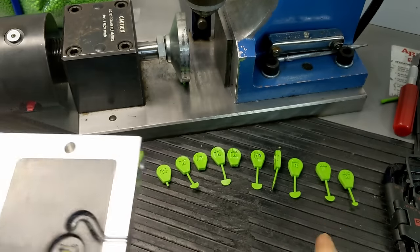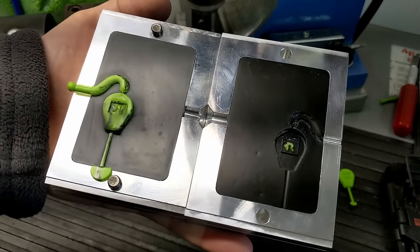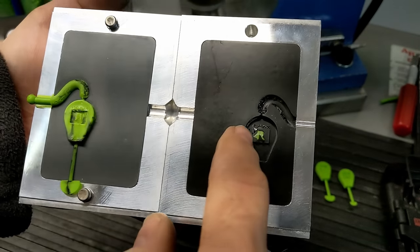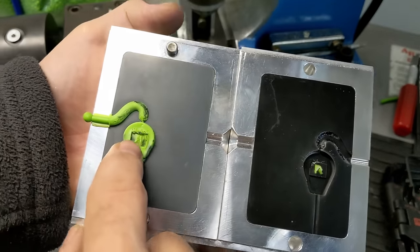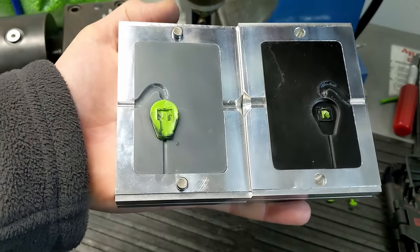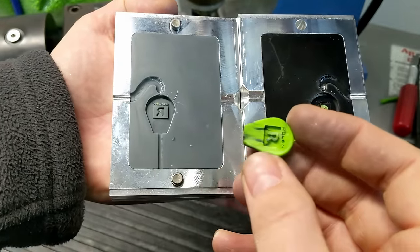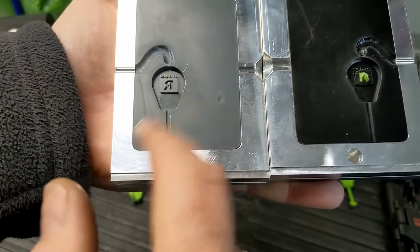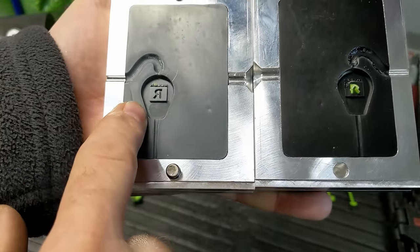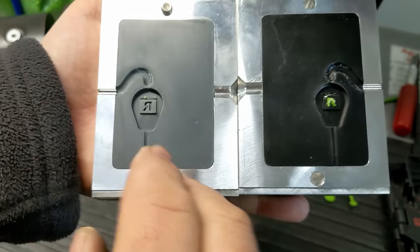This was our latest shot and we are 12 shots into this. You can see we've now reached total critical failure for the low-temp side of the mold — it's just melty and gooey. The details of the mold are totally obscured, lost, destroyed. We're now getting into stuff we don't really want to mess with because it's essentially resin toxins, so we'll stop there. But interesting to note how well the high-temp resin held up — it actually works awesome. We've learned a lot about mold design from this and know what not to do next time with low-temp.